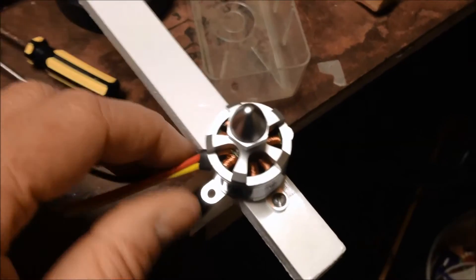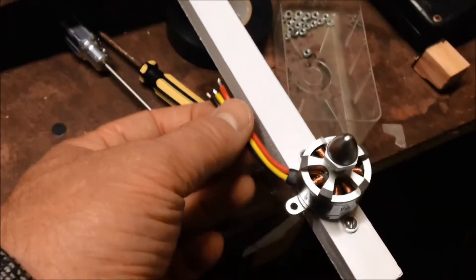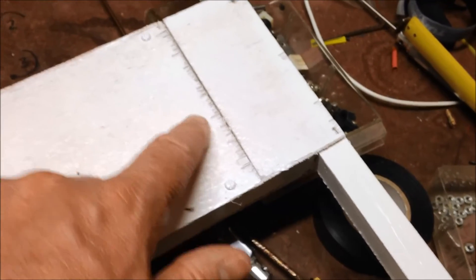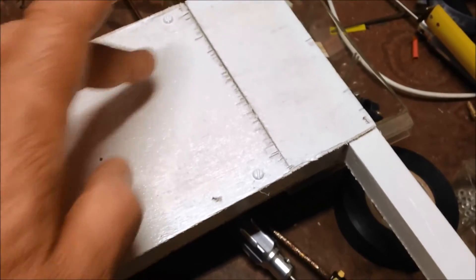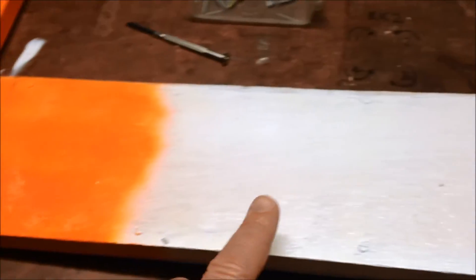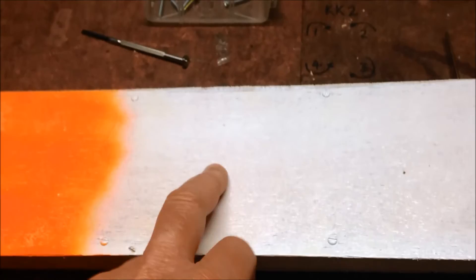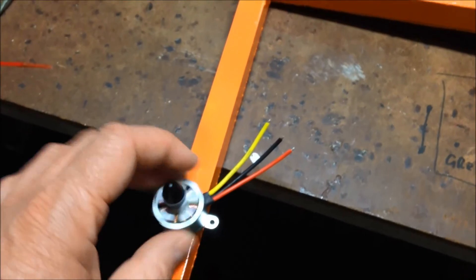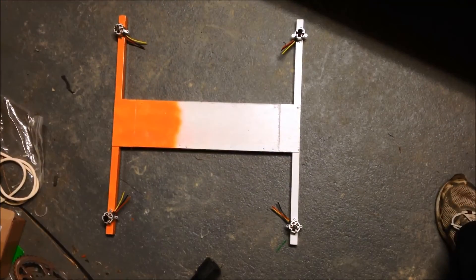The motors are mounted, got the cables coming out to the inside of the arm so they can run along here. I'll put a bit of a hole in the middle here to run into the ESCs, which will probably live under here. Put a few holes appropriately through here for ventilation into the ESCs and the KK board, which will sit in here. See how these 2212s go — looking good. That's the frame, that's how it's going to look.